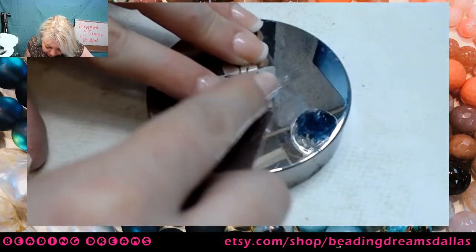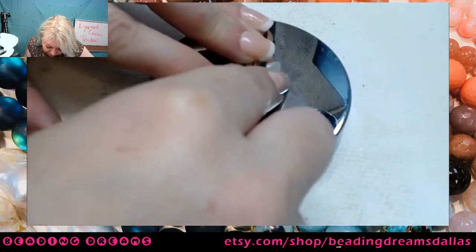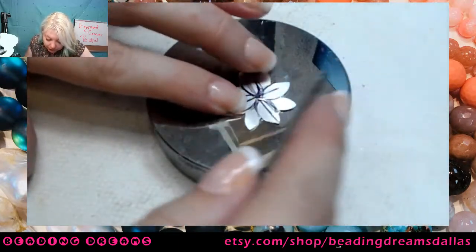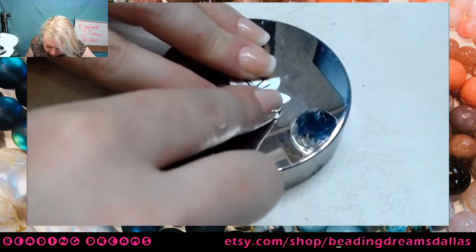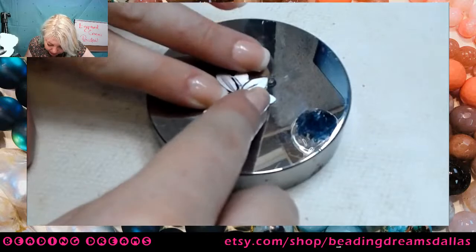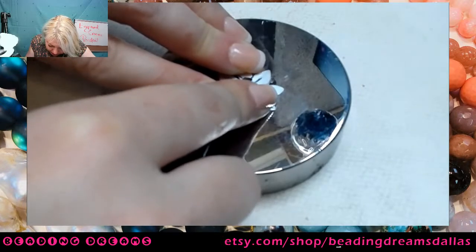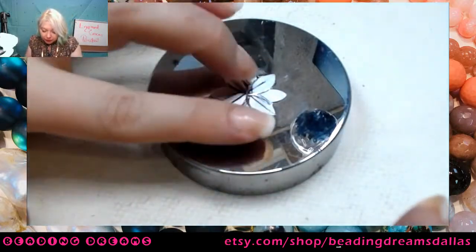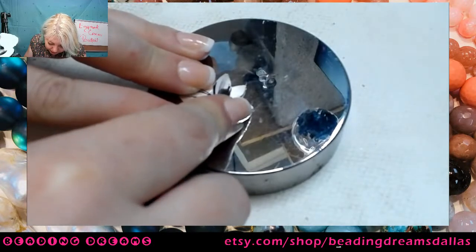Lori's learning to carve leather by trial and error does bring this to the forefront of my mind: if you're trying to teach yourself to engrave, maybe don't start on sterling silver. I started on copper, with scrap pieces of copper, and just practiced on them, because it took quite a while for me to get the right amount of pressure with the graver. For a while I was pressing too hard, and when you do that, it just gets stuck.